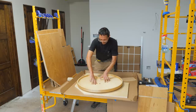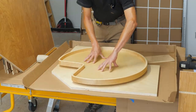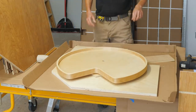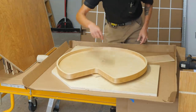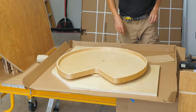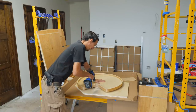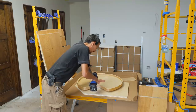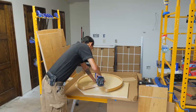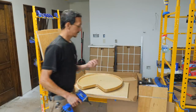So I'm gonna press down and rotate this entire thing without moving the base underneath. I'm gonna expose that first corner, and we are going to drill a hole and put a 3/4 inch wood screw down through there. You don't wanna get too long because you don't want your screw going through your shelf and having little pokies on the bottom. So we're gonna fasten that first corner. 3/32 bit. Got my corner, I'm pressing down so that the base does not move off the shelf while this can rotate. I'm gonna center that and get me a pilot hole. Three-quarter-inch wood screw.